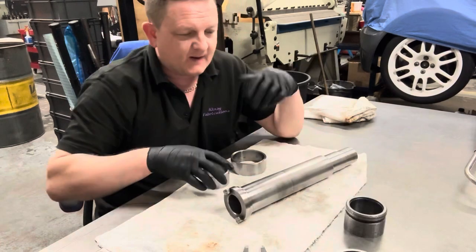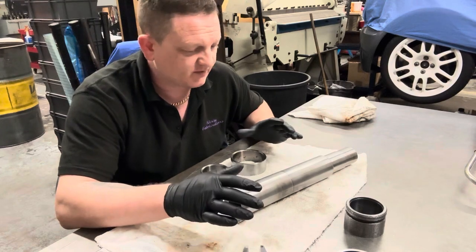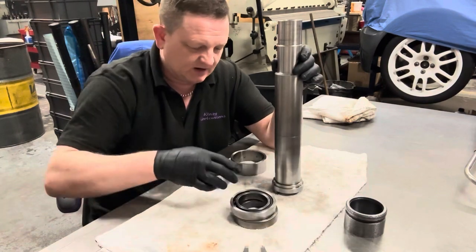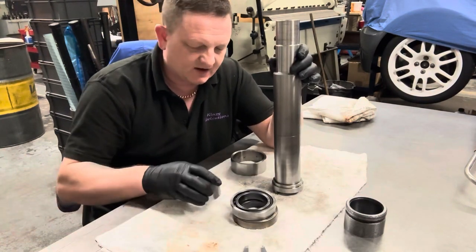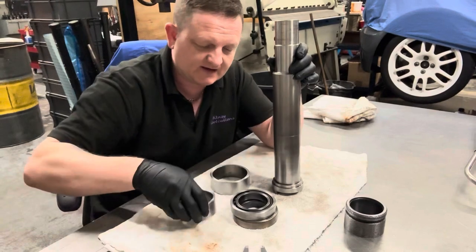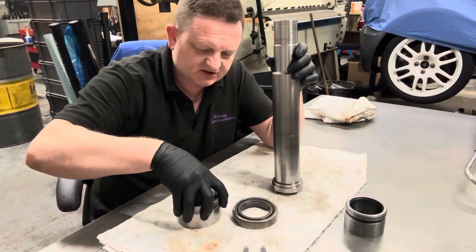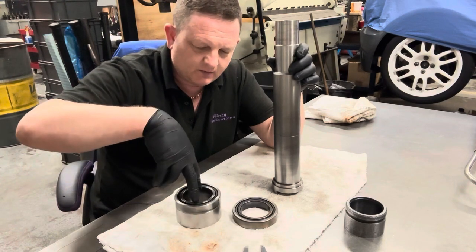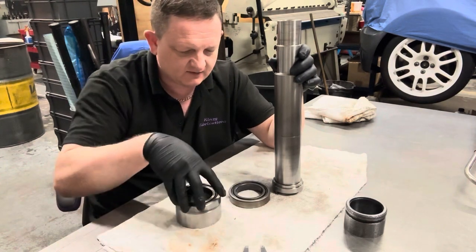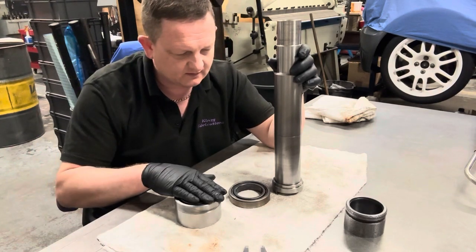When I put these bearings back on, what am I checking and what needs to be measured to make sure everything's good? Because there's no set shoulder where this all sits, I'm guessing this stack height, as long as the inner and outer are the same, I guess you don't want these to be different thicknesses, so I'll have to mic the thickness of that and then mic the thickness of the outer one. Where the bearings sit, I assume it's only when I'm pushing down on the inner and outer, you're going to compress it to a point, you don't want to go too far.